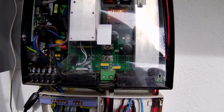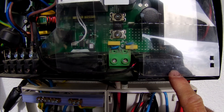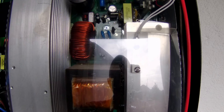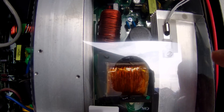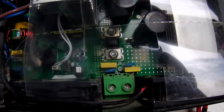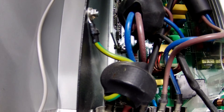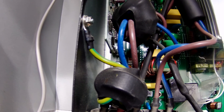Basic electrical knowledge and common sense gets you a long way. You've got two fans here - they're obviously for cooling. They're opposite two heat sinks, so obviously to cool those heat sinks. There's also two wires that come to a thing and don't connect to everything else - they're obviously some sort of sensor. With them on a heat sink, it's safe to assume that's the heat sensor. At the end of that heat sensor there's just a plug-in connector, and on these fans they're just press-fit connectors as well. So I'm going to unplug the connector on the fan that's not working and take them out one at a time.